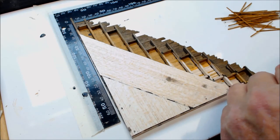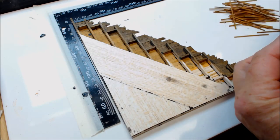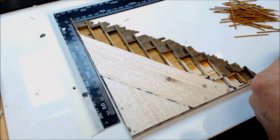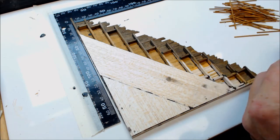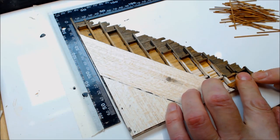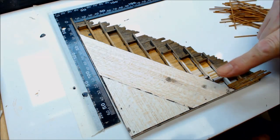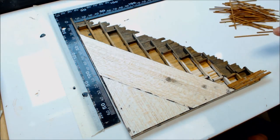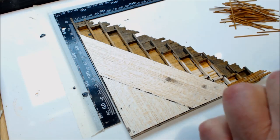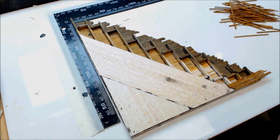The pieces are glued on nicely and dry. Now we move on to putting our laths along this side. I've got a little pile of offcuts which happen to be the right size. I'll be gluing my laths starting from the bottom in a straight line, keeping them as straight as I can, all the way along - leaving just a tiny gap between them, about the thickness of a piece of paper.